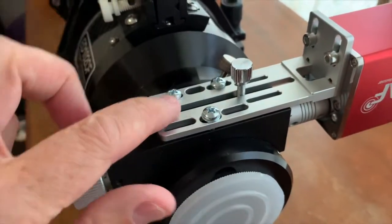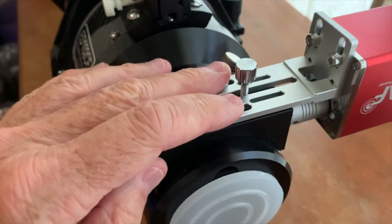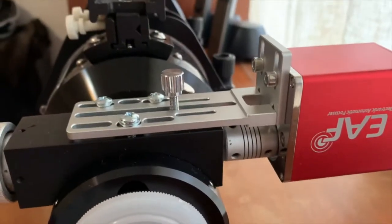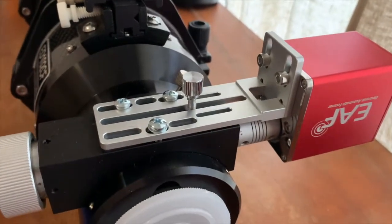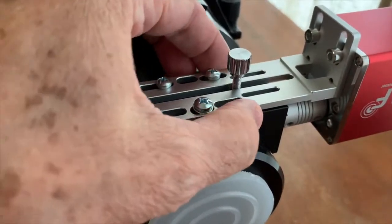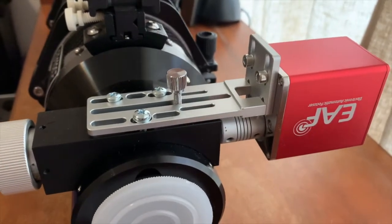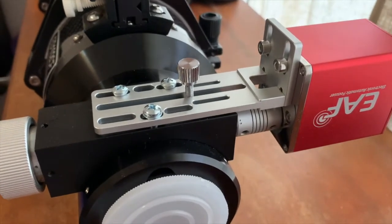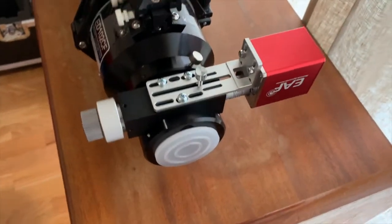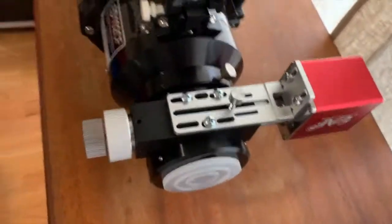All you really need is these three screws. Take them off, put on the new longer 16mm screws that come with the ZWO, along with the coupler, mount everything loosely, make sure nothing is binding, and then once it's all together loosely you can start tightening those screws. I tested it out and it's working. It seems nerve-wracking to try but in fact it was pretty easy.